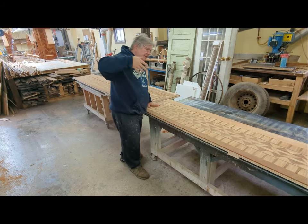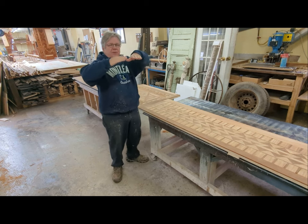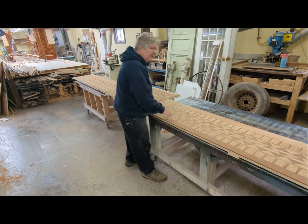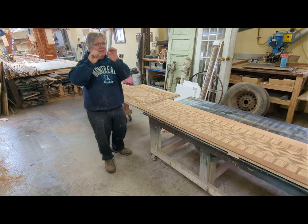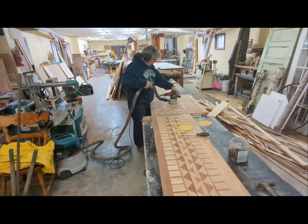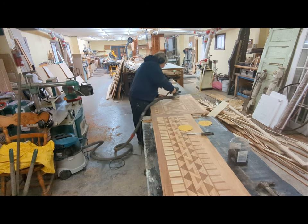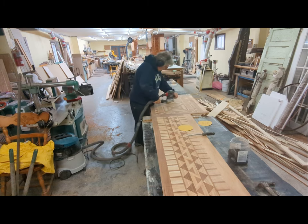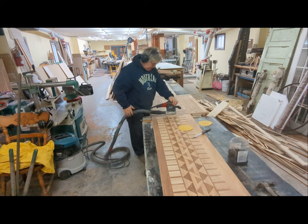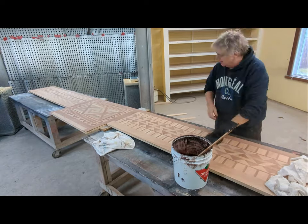The only reason for the pins is to keep pieces pushed down — sometimes a little piece gets wet or turns slightly. And there will be almost zero wood movement with this — same as the other time. With sanding, go up and down, left and right. My seam is a little higher so I tend to work there, but same token you don't want to create a valley. You'd be surprised how easy it is to do that. When you create a valley, you really notice it when you apply a high gloss or any type of finish — so be careful.